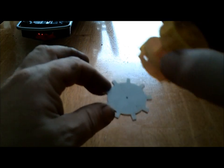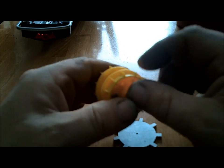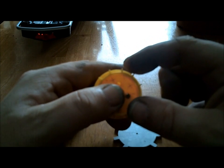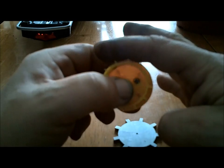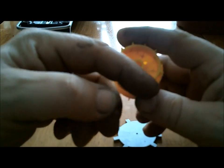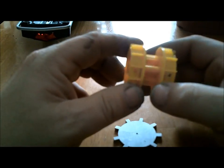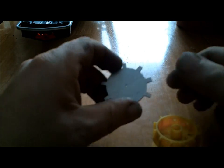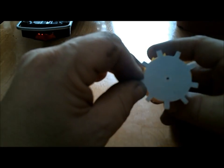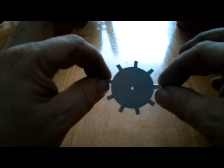When I tried to do it with the original drum, I was going to put holes through here with nuts and bolts, leaving enough of the screw head or the screw sticking out to go through the track. But oddly enough, when I put the holes in and started going around following the track, the last pin would not line up with the next hole. It seemed to miss a line somewhere along the line, and it didn't work. So evidently I found out that the slightly smaller diameter than the top of the drum here made the teeth match up perfectly with the holes.